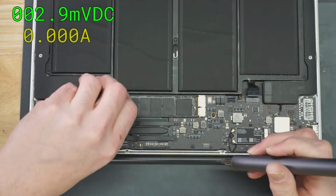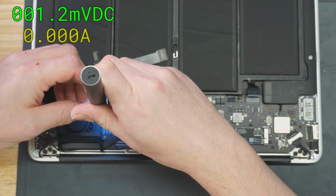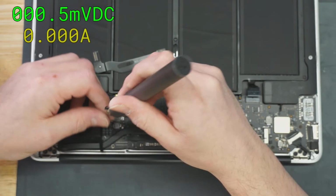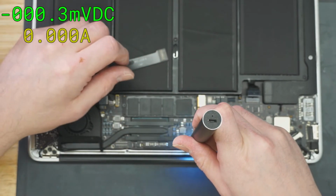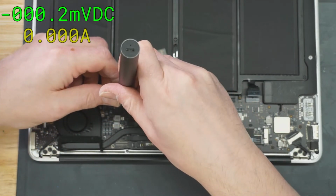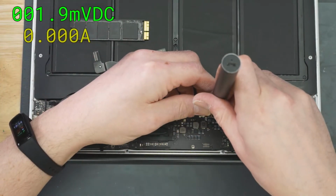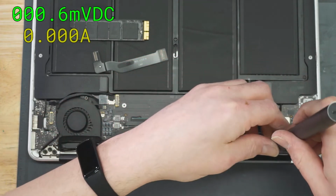So this one, hovering around 30 milliamps, is almost always the U1950, and I should have grabbed a donor board while I was out there. Oh wait, Lewis has donor boards. U1950 has to deal with Allsys power good, so you'll be missing Allsys power good because of U1950. Or it could be something else in the chain of Allsys power good. But the most likely culprit is U1950.